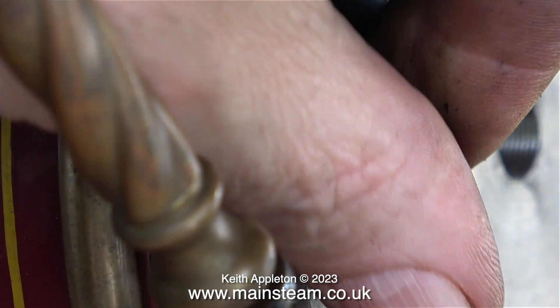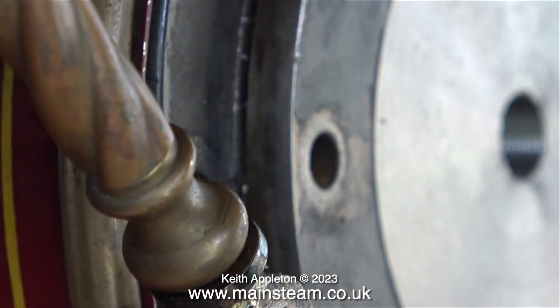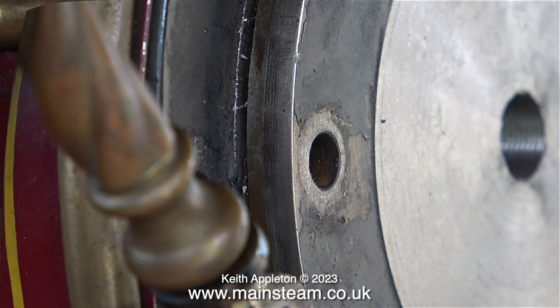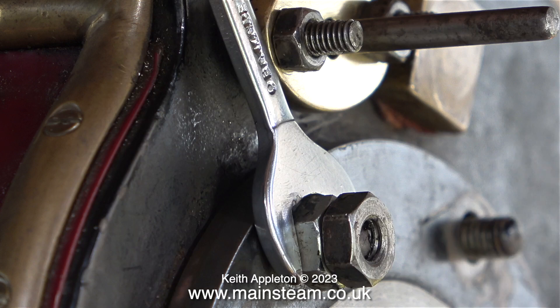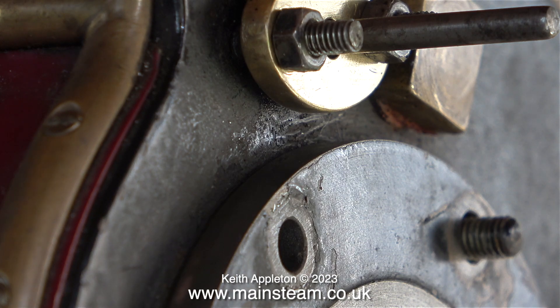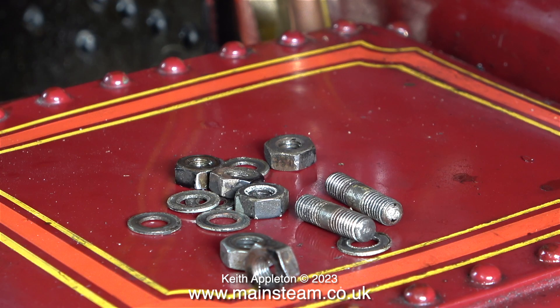In this clip I'm not using any super strength — I've already used the spanner to slacken off the stud and I just removed it by hand for the final bit. With this stud now removed, it's time to do the same to the one above it. Same principle: a couple of lock nuts, undo it with a spanner, and when it gets slack enough just spin it out with your fingers. All of the nuts and bolts from the cylinder I put on top of the belly tank so I knew where they were, and as you can see they now have a couple of additions being the studs I've just removed. I'll take these into the workshop and shorten them slightly.